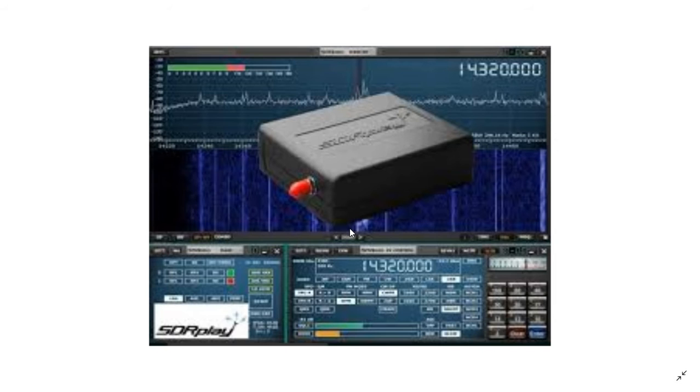I have the ambient noise level — that doesn't change because I've got a lot of noise around me. But I do notice that there aren't these lines of intense interference every several kilohertz like you see. Especially the 19-meter band was the one most affected by this. That is a big difference.